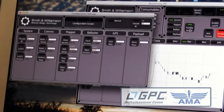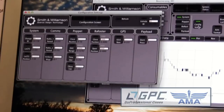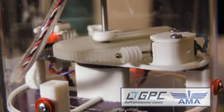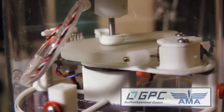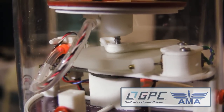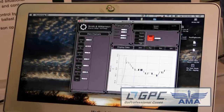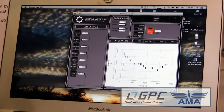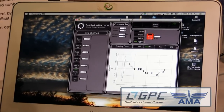Across the top, you can configure a variety of settings stored in EEPROM onboard the primary flight control computer, including the loss-of-comm failsafe parameters — you can set how long before the system cuts down if you lose radio communication. We can control the valve, dump ballast, and there are user-configurable payload interface buttons. It also shows remaining ballast and lift gas, and computes distance, bearing, azimuth, and elevation so you can point a directional antenna at the balloon.